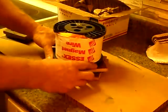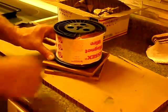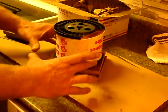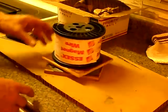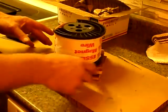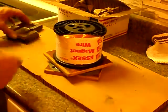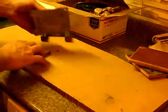And you want to start with something that's a known amount of resistance. You could just use milk jug high density polyethylene washers, big ones, and put under there because they would slip perfect every time. I just chose to do it this way. You've got to get it where it's the same every time, and then, I'm about to show you what I'm going to wind it on. This is a microwave transformer.